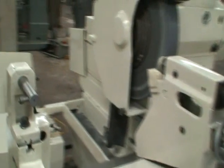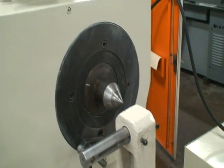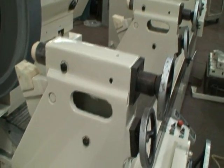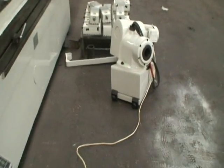Table-mounted wheel dresser. Number 6 Morse taper. The grinding spindle motor is a 15 horsepower, wired for 230 volt. Three steady rests. Center grinding attachment is over here.